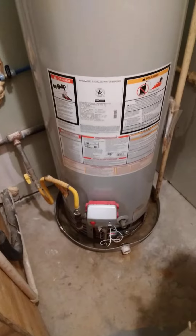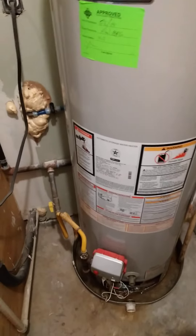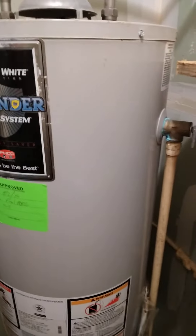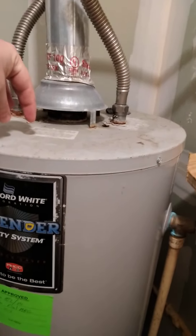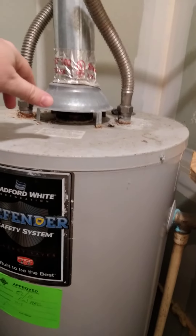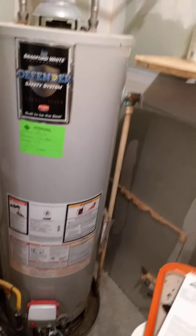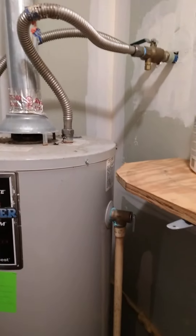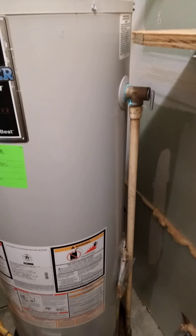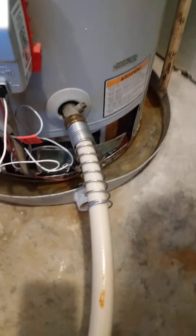You've got water up to the top of the tank and you need it down to a lower level, so you'll want to drain some of it out — it also helps rinse sediment out of the tank. Some water heaters have an anode, which looks like a large bolt or screw inside the tank. You want to replace that periodically because it helps prevent the tank from rusting on the inside. So: step one, turn to pilot; step two, turn off cold water inlet.